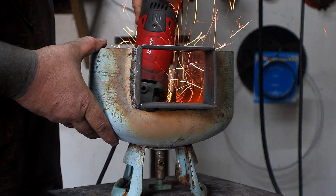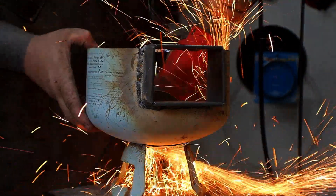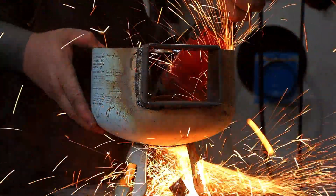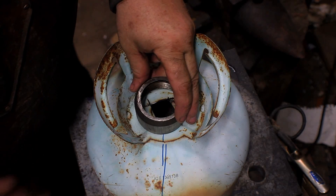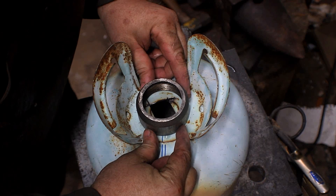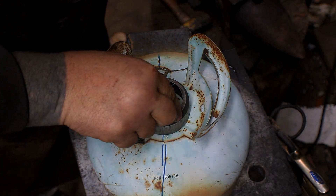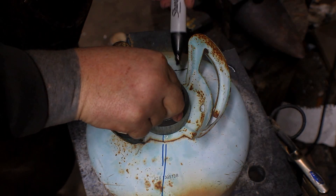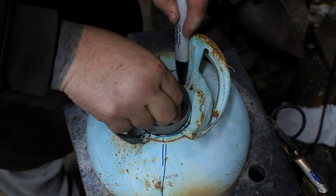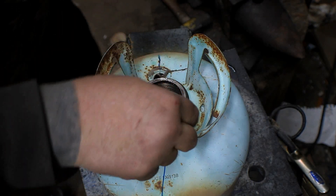Just a little minor surgery here — we have to take out the spout where the helium came out so we can plumb our burner in. This is one of the bell reducers we modified; it goes from 2-inch to 3/4-inch. We cut the lip off of it so we can get just the circumference of the bell without the lip, slide that bell reducer flare up there, and the lip will sit on the inside so we can make a better weld.